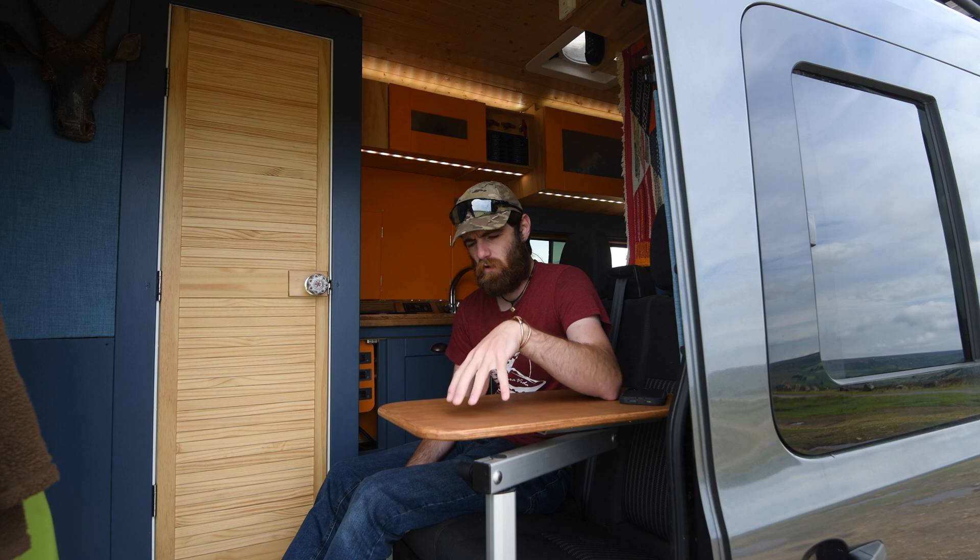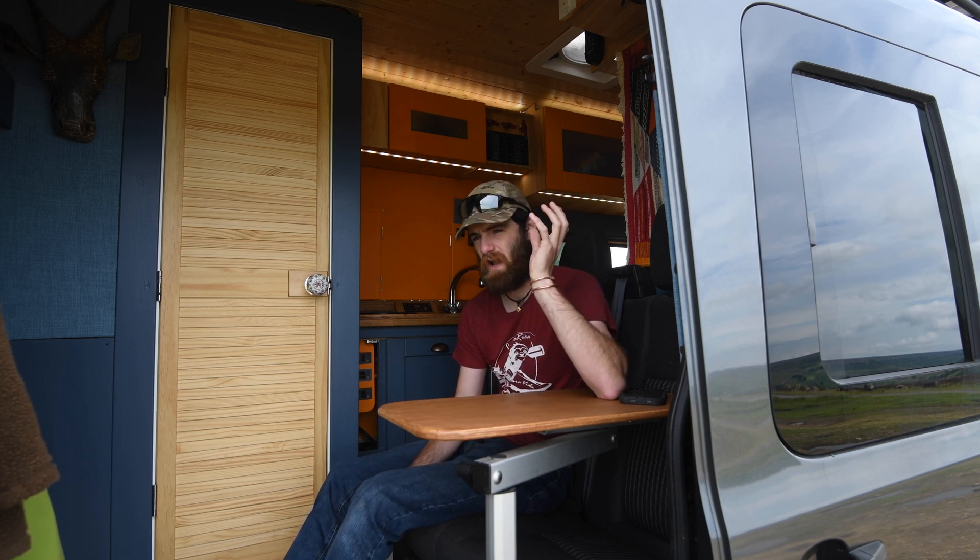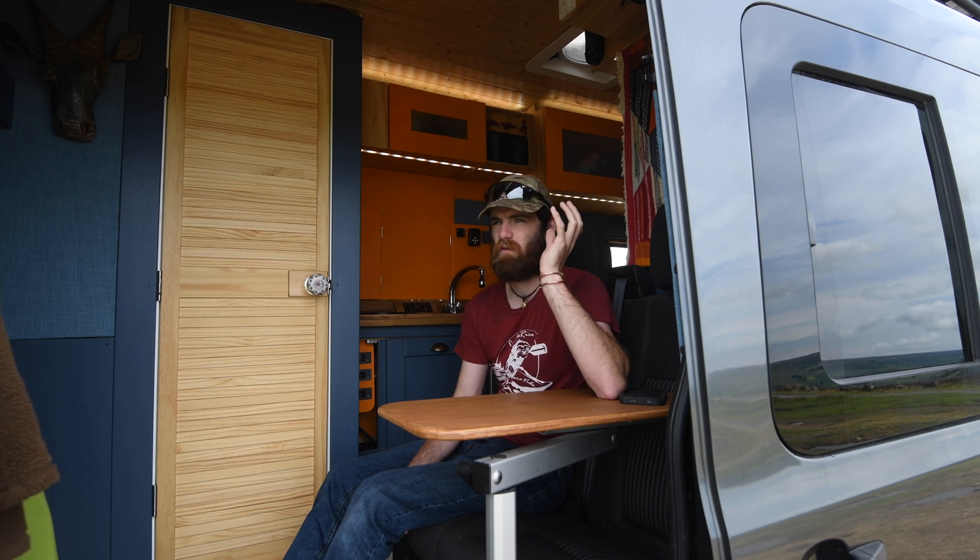A 300 watt electric heat element is going to draw about 25 amps at 12 volts, but I've got 500 watts of solar on the roof. On a bright day I'm easily above 350 to 400 watts, and on full sunshine I can hit about 500 watts — 590 watts is the highest I've seen, which is great considering I've only got 500 watts of panels.